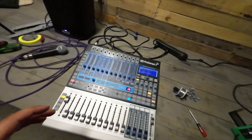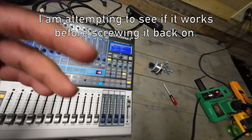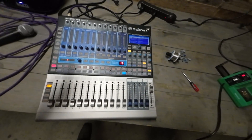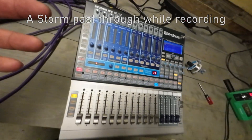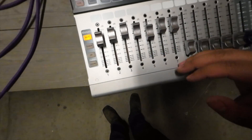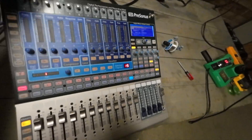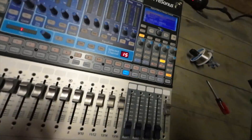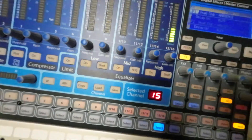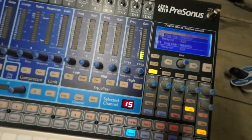I got it back together — the soldering took a while and I had to be really precise, but I got everything reassembled and plugged back in. Mind the noise outside — it's pretty windy and rainy. I've set the faders at unity and I haven't tested this yet. Starting on channels 15 and 16, which is where we know it worked before — checking mic, one two, and I can see signal coming into the input. It worked.